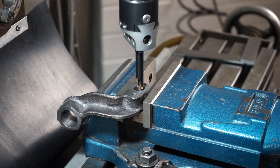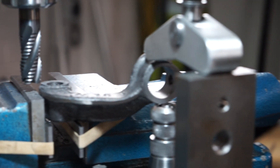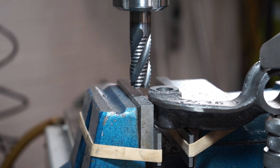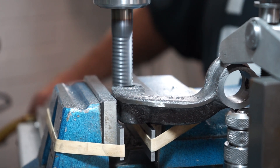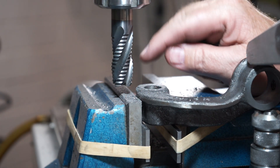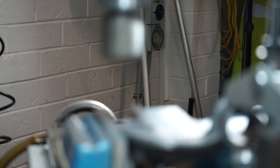That was actually too fast - I flicked the switch in the wrong direction and kept going, so I'll have to check that now. As you can see I've got some weird and funky work holding going on here. I'll flip the part over and to hold it I've got my screw jack under it, this block of steel, and my little toe clamp there. Hopefully I can hold that and machine it safely. I've got to be an inch in thickness here so I'll give that a quick mic-up and see where I'm at. This cutter here is one that Tom gave me from Hilltop Machine Works - it leaves a really nice finish on this SG cast that I'm machining today.